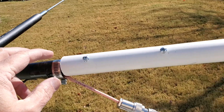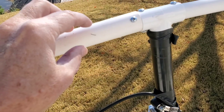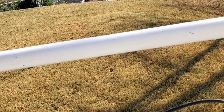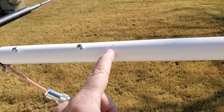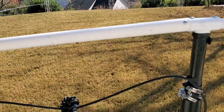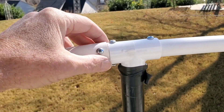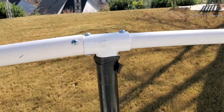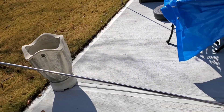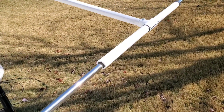The dipole slides into the one-inch PVC, and inside that there is also a three-quarter inch piece of PVC running partway through, so the dipole slides in and meets it - this makes it pretty solid. On the other side, there's just a piece of three-quarter inch PVC that connects to two more telescopic whips, which form the reflector element.